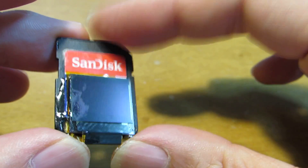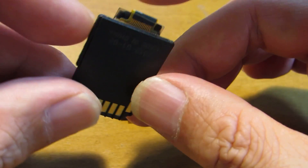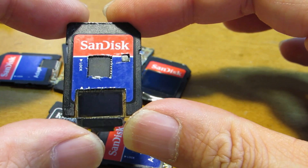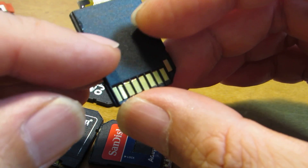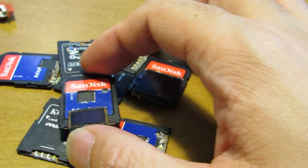As you may remember, before I made SD card-sized Arduinos — some of them have a screen like this. This is a bigger screen and this is a smaller screen. Some of them have onboard pressure sensors and so on. But there is a fundamental problem: the main chip of this Arduino, the ATmega328, has a lot of digital I/O, but due to the limited number of electrodes, we cannot fully activate the full function of the ATmega328. So this time I made another one.